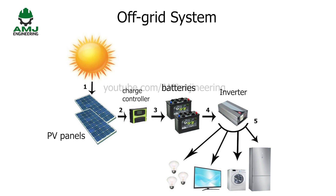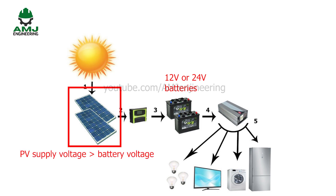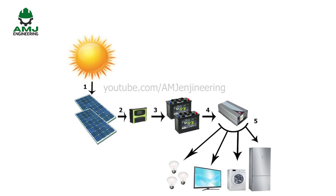These are the must-have components in any off-grid system. Let us move forward to see how to size these components. The off-grid system could be a 12 volt or 24 volt system, meaning a 12 or 24 volt battery system. In both cases, the PV panel selection must be of higher voltage than the design battery voltage to be able to charge the batteries. Let us see why.